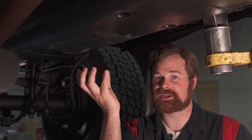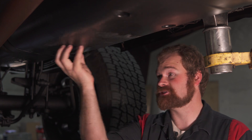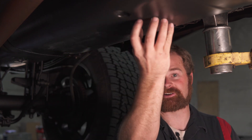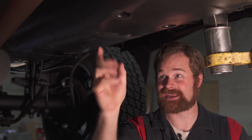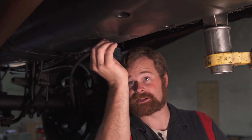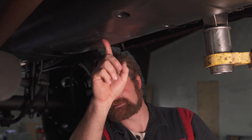When you're putting your sump in, you want to find the lowest part of the tank. For us, that is right here. Every tank sags a little bit different — sometimes it's right where the factory sump is, and sometimes it's in another place. We're going to put it right here and we're going to use a three-inch hole saw. You want to find the lowest part and then put it in the center of the tank, which is going to be right here for us.